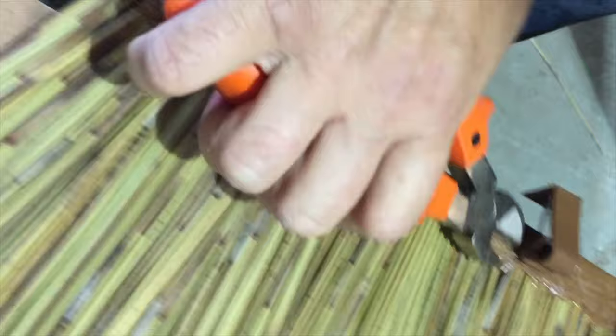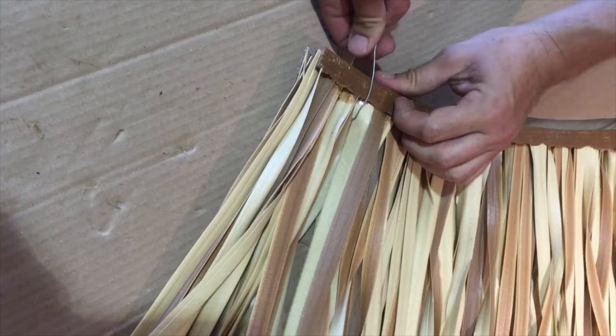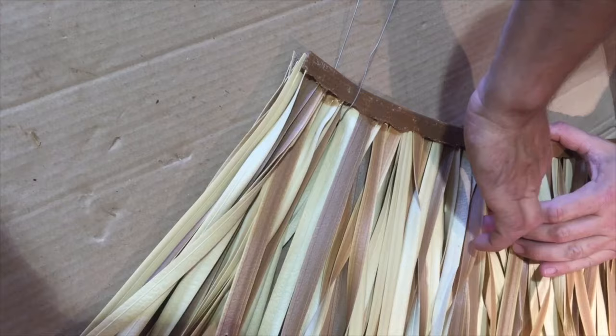Be careful of the sharp staples. You can screw the tiles on straight through the latex rubber strip at the top. The tiles can also be wired on using stainless steel wire. It's worth putting 12-inch strips of wire through the tiles before you put them onto the roof while they're still on the ground. If you space them the same span as your hand, you should get 5 or 6 per tile — approximately the same as if you were using the plastic clips.